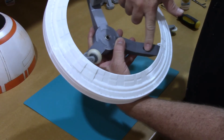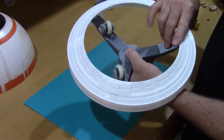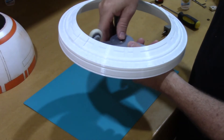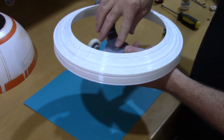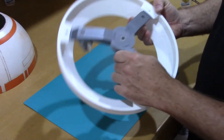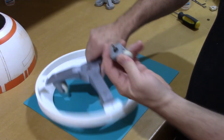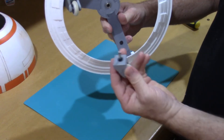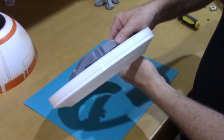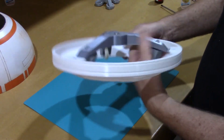The nylon inserts: make sure the smooth side is where the caster will ride, flush with the arm, then take a razor blade and cut it off on the back side. There are two ball bearings countersunk into the structure, top and bottom — if they don't fit completely flush they should only stick out about a millimeter at most. If needed, use a half-inch drill bit to flush them in. Once assembled, the casters ride on the nylon bushing. The little rubber piece is only there to keep the caster from falling off.